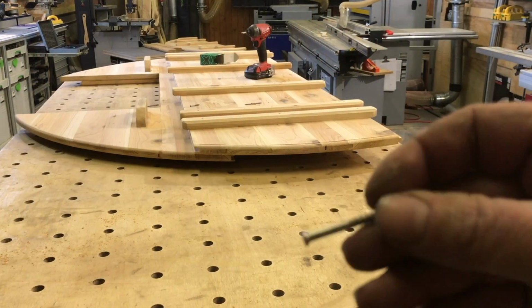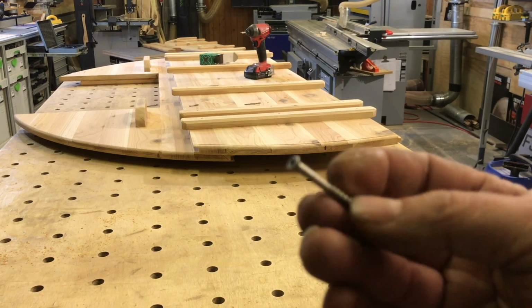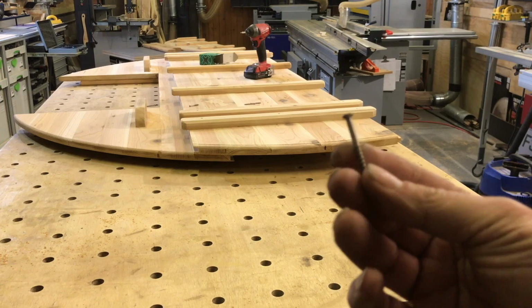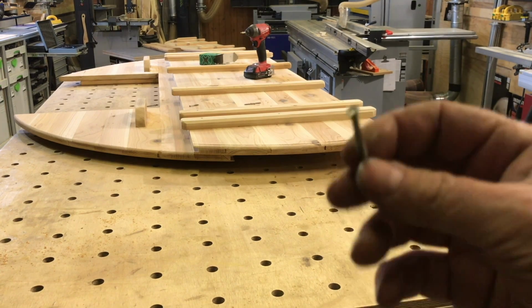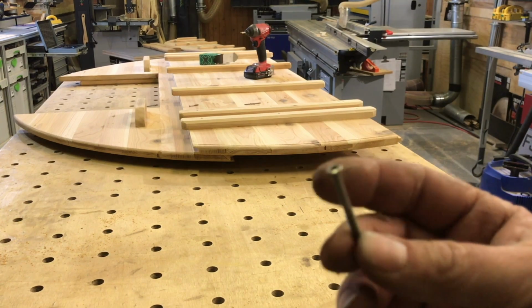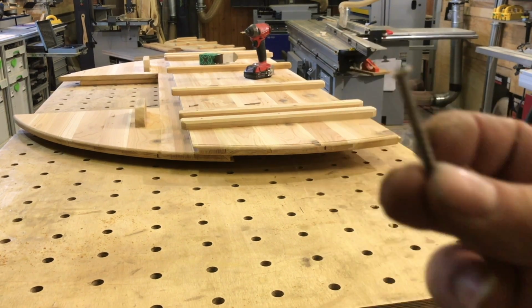So the screws I'm using are these SPAX screws. I can put a link in the description. They are £20 a box in the UK, so they're not cheap for 100, but they don't tear out and the heads disappear. Once the wood swells, you won't even see it. No need to countersink, but bloody expensive.